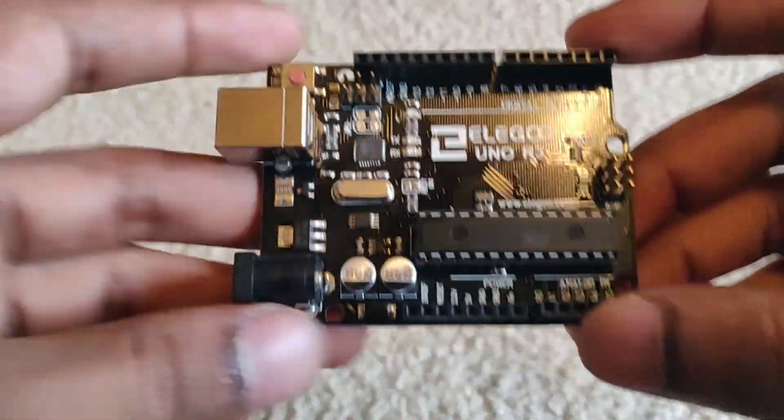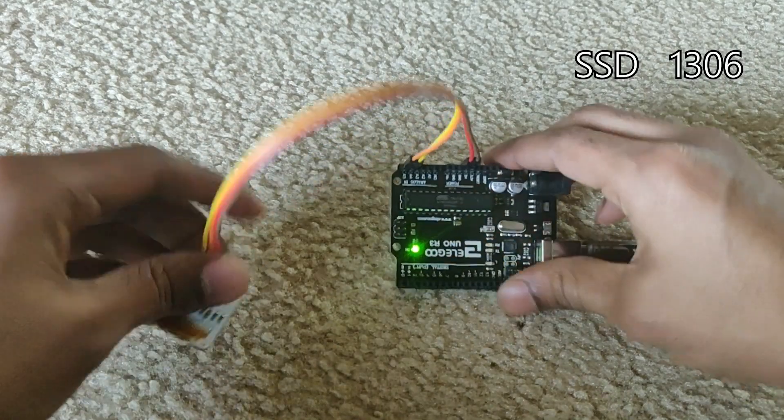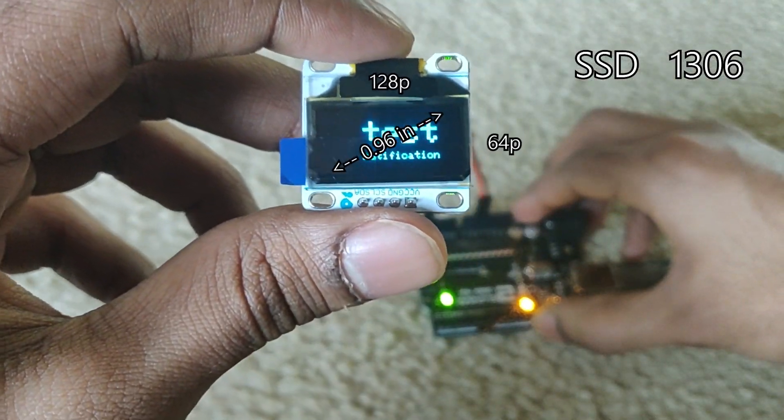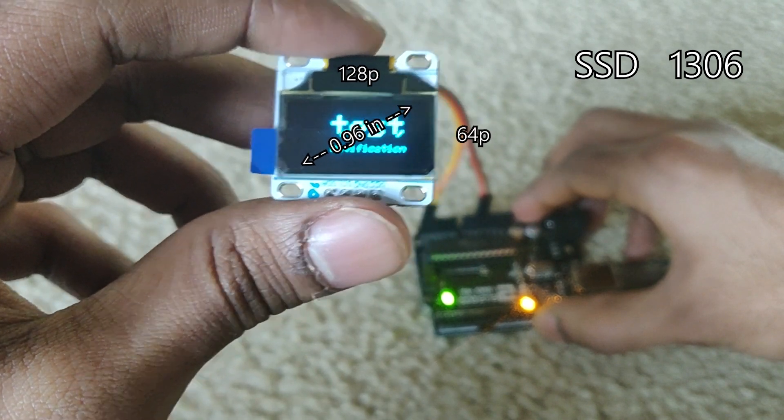So I wanted to try something like that. I got my Arduino — it's an Arduino R3 — and I found this display that I had. It is an SSD1306. It's 128 by 64 and it's 0.96 inches in size, and it uses I²C to communicate with the Arduino. In order to get it close to my face without it having to sit way out in front of me, I used a lens that I popped out of a Google Cardboard.